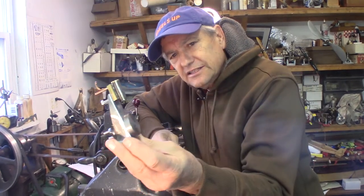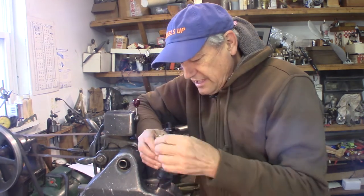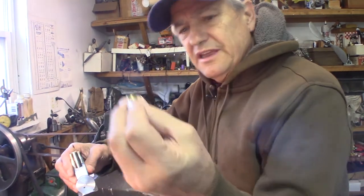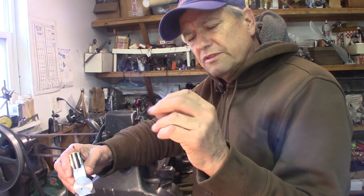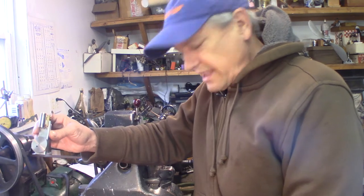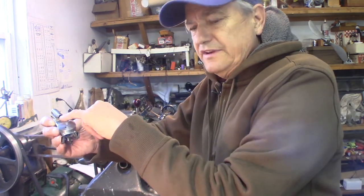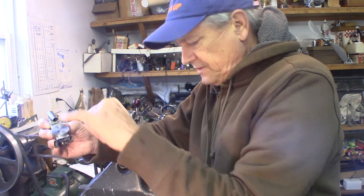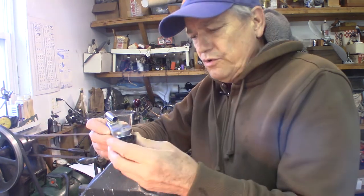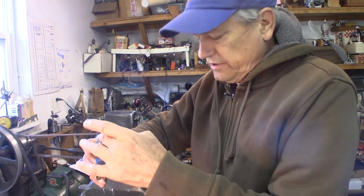Got the little oscillating steam engine from Vic Smead's book here. It's well underway. I had kind of a piston made that turned out to be too small — this was made out of a bathtub faucet. I did find a bar of brass; I have it here in the vise to machine the piston down to a tight fit. It won't actually go in all the way.